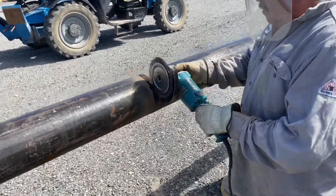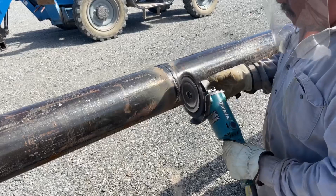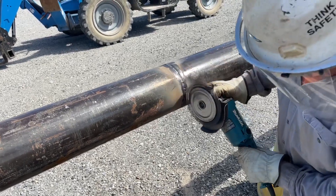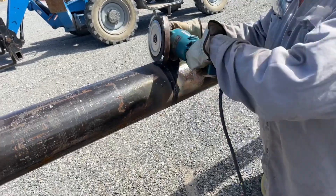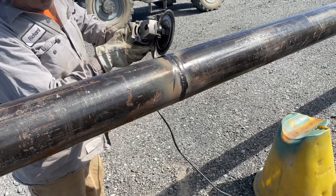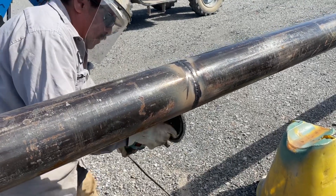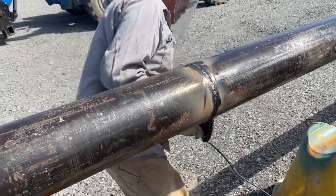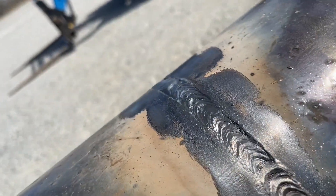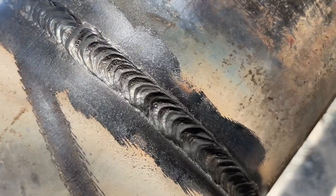I'm stepping all the way past, going back over what I did before, and I'll show you what it looks like. That's the filler. We're going to put the cap on it. See how I didn't — that's what you don't want, right? About there — see, I started breaking that bevel down. You don't want to do that. You want to try to keep that bevel aligned.